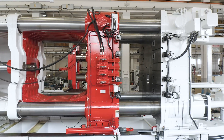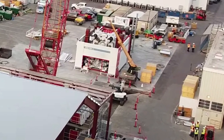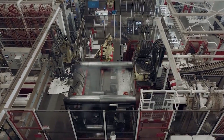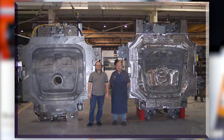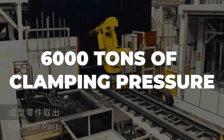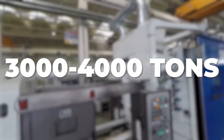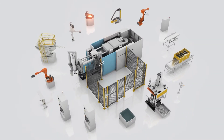The machine has the volume of a small house — it was so gigantic that it wouldn't even fit inside the Tesla Fremont factory. They had to just drop it in the parking lot and operate under a makeshift roof structure. In terms of strength, we measure die-casting machines by their clamping force. The machine injects molten aluminum into a die, which is a hollowed-out mold with two halves cut into the shape of the part you want to cast. The larger the part, the larger the die, and the more pressure required to hold the halves together while liquid metal is pumped inside. The Model Y casting dies required 6,000 metric tons of clamping pressure — the previous most powerful machine had maxed out between 3,000 and 4,000. This wasn't just an incremental notch up; this was a step change for the entire casting industry.